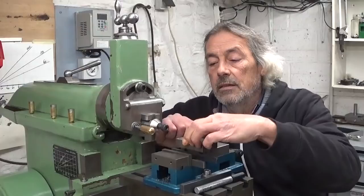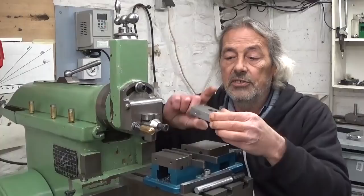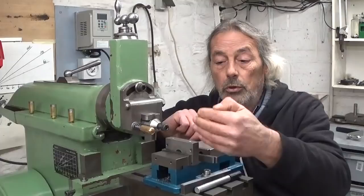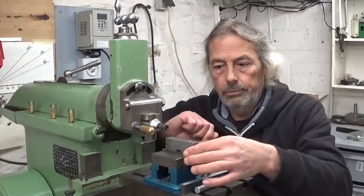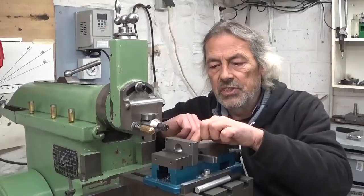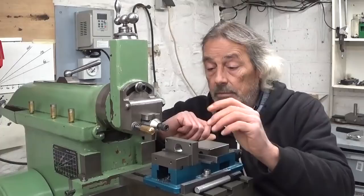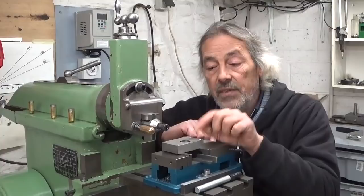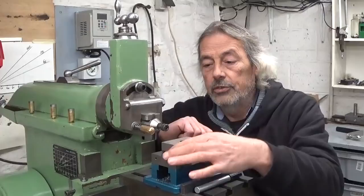Surface is finished, flip my part around, do this surface. So these two are now at thickness and parallel. I put my part for the third surface like this in the vise. So it will be square with the vise. Work this one. Part finished. Do the face number 4. Same, bring it to thickness. Yeah, and then I have to turn my vise around because there's not enough reach to put the part this way in the vise. So turn my part around and then I can do this surface and this surface.